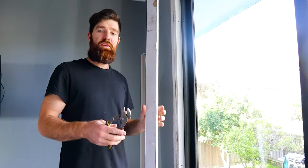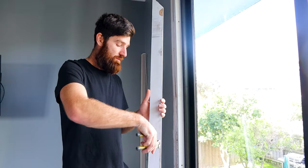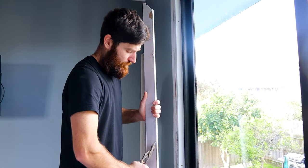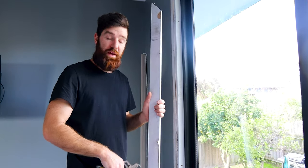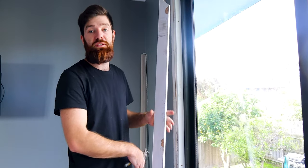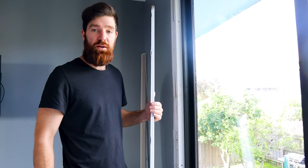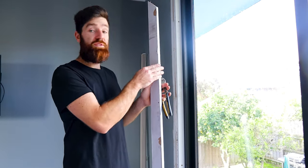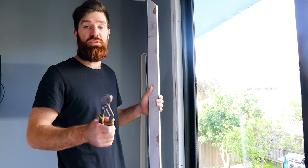The last thing to do is pull the nails out of the architrave. There is a better way to do that than hitting them back through the face. You can actually pull them all the way through and that way you will minimize the damage and there'll be less holes to be filled. So this is my architrave here — that's the front, and this is the back with all the nails poking out. Just grab a pair of pliers and pull them through. We'll grab a scraper or a chisel, get rid of that no more gaps, and then we'll start cutting these to length.